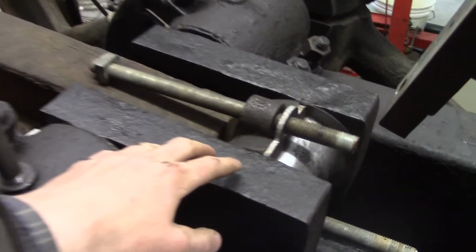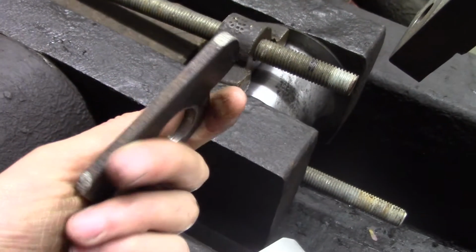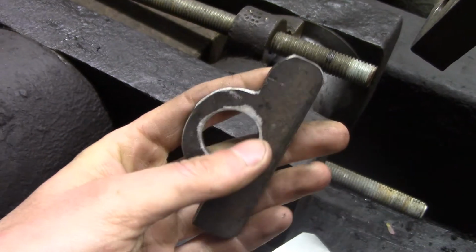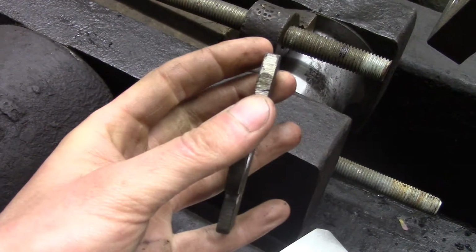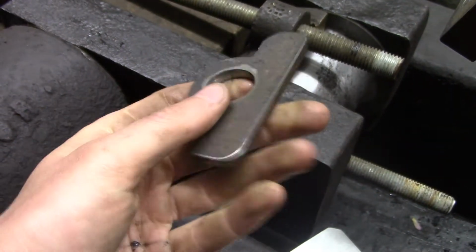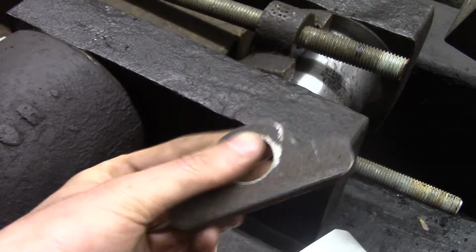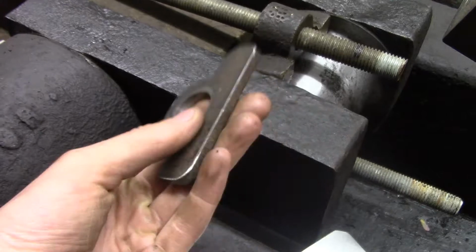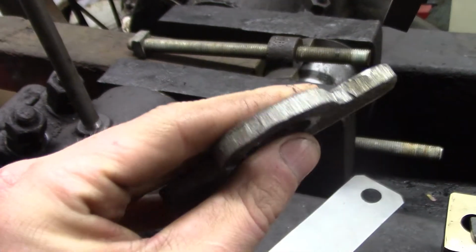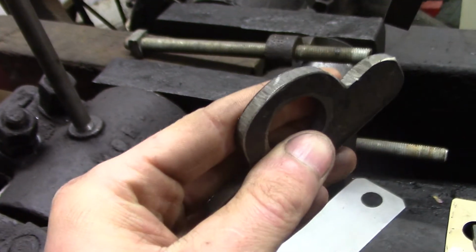And I also have these spacers that I made. They're 1/4 inch thick spacers, basically a shim, but just one thick shim. I'll be using these to give the bearing the proper shim clearance when I'm pouring, because this will be a lot better than a whole bunch of thin shims. And then later I can either use this as my shim, or I can remove these and use my previously made thinner shims and just stack them up to whatever turns out to be a good amount of shims.